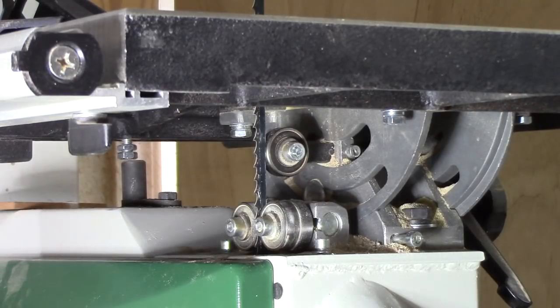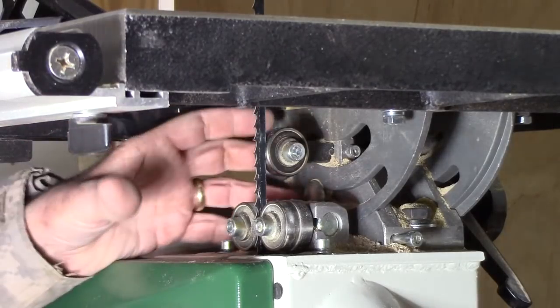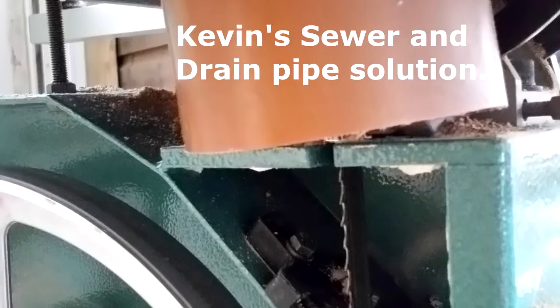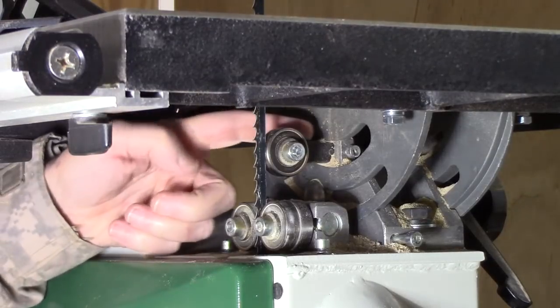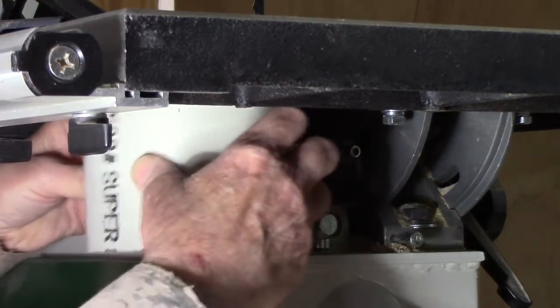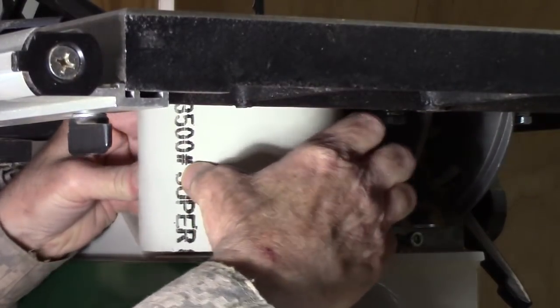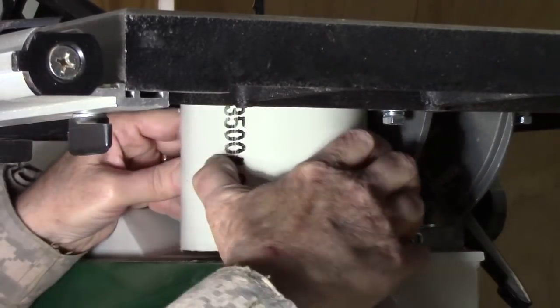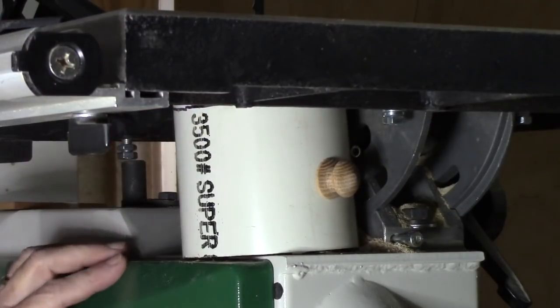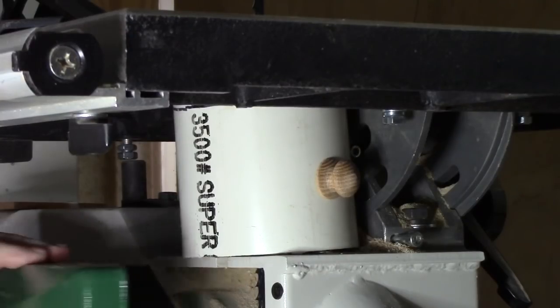What I did was take a tip from viewer Kevin Ganey, who sent me some pictures of his setup. Basically you want to build some type of housing around here — you could build it out of foam — but it's got to be something that's easily removed. His suggestion was to use four-inch sewer and drain pipe. I put a couple of handles on it and a little notch to clear the bar that projects out, which just makes it easier to pop in and out. Because it goes all the way to the top, it provides a nice channel for the dust to get sucked out through this hose.